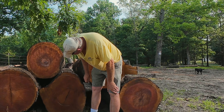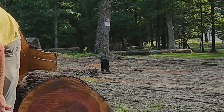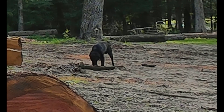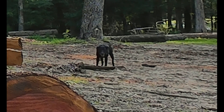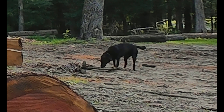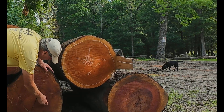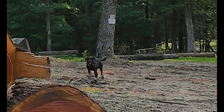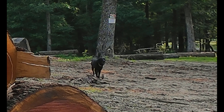Big log. Take out the sapwood, stay out of the shaking zone. But this has got a lot of defects in it. People will buy this thinking it's a really good log, but when you look at all the cracks in it, this one's not going to be real good. I didn't pay a whole lot for this guy. This one could be a disaster — there's shake there, there, there, and here. Hopefully a lot of those defects don't run all the way up the log. But as I'm sawing this, I realize the yield on this is going to be about 50%. Not going to be a good one.